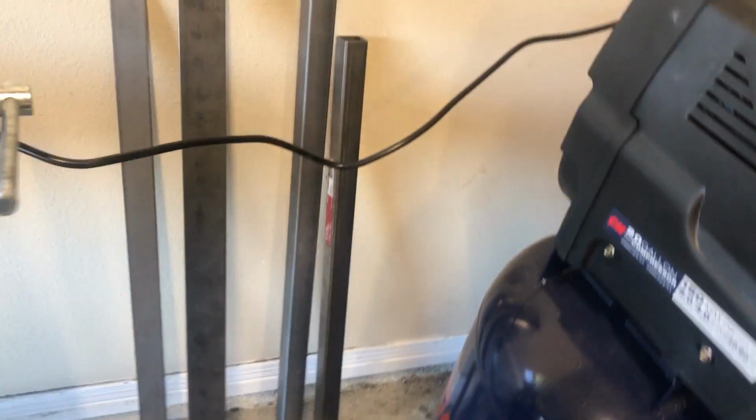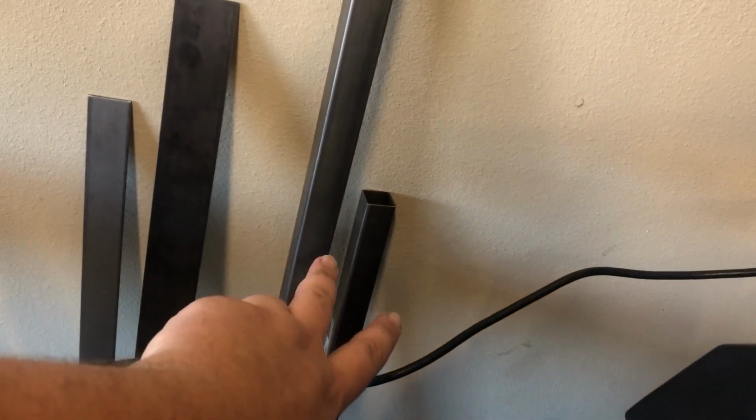This is extra, and then I'll have to do one butt weld on these two guys right here to span the whole width of the trailer, not the length. Anyway, I have to make a good butt weld. I made one before and it was strong. It penetrated fine. I couldn't break it. It just wasn't that pretty.